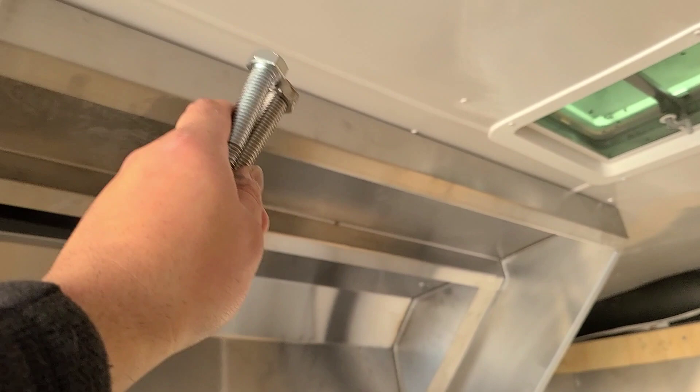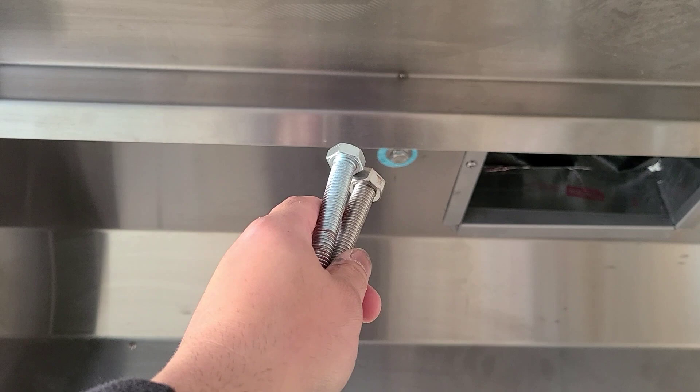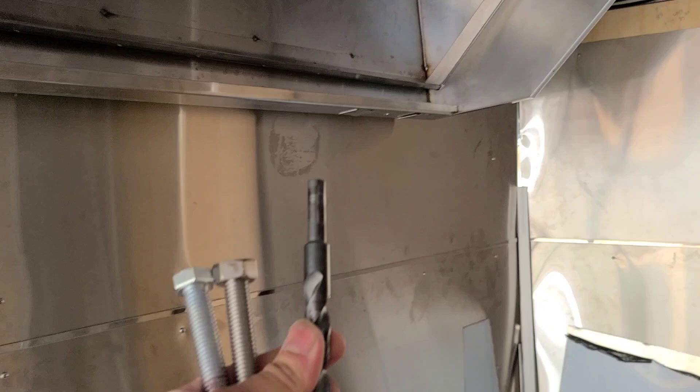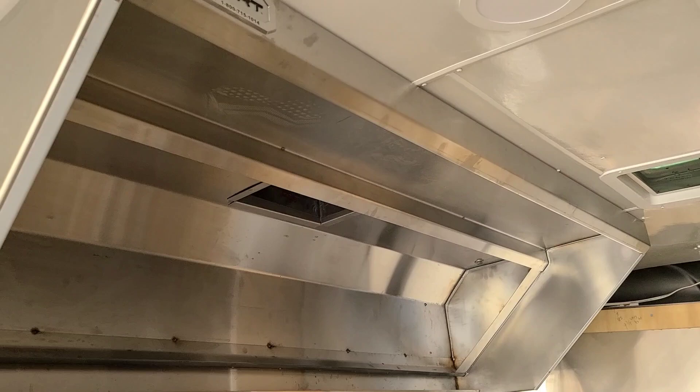Everything is spaced on this trailer on 24-inch on-centers — that's where the metal is going across the trailer from one side to the other. We measured from here to that stud right there and got the measurement. We did the same thing on the others, with two more in there. We took a half-inch drill bit and did a pilot hole — a pilot hole is just taking a smaller drill bit first to make sure you're exactly aligned, then you make the bigger hole. That's how we installed this 6-foot concession exhaust hood.